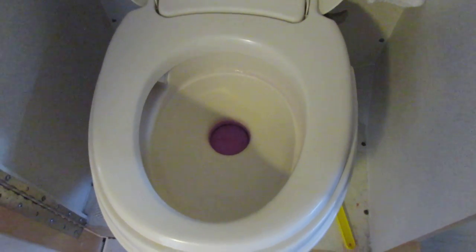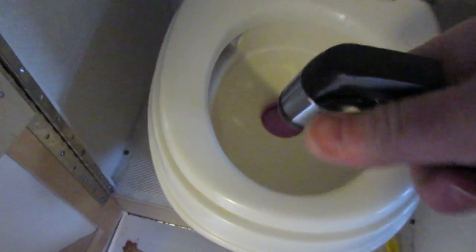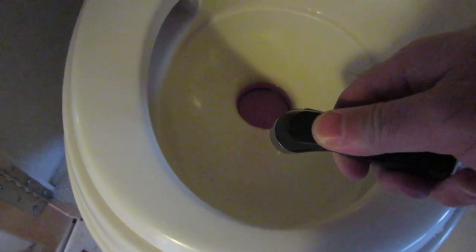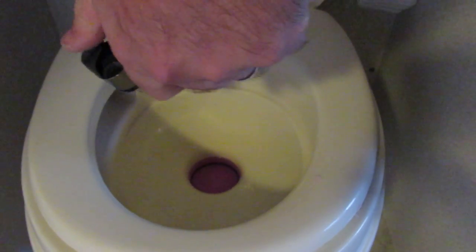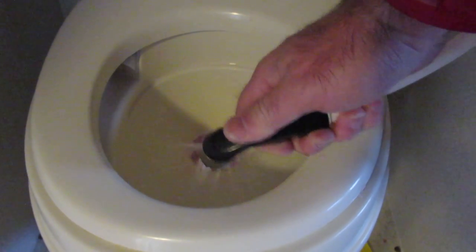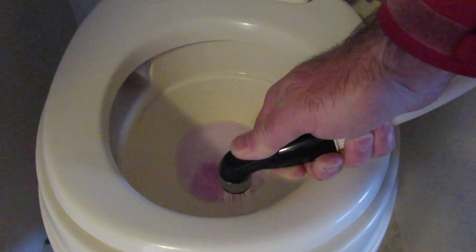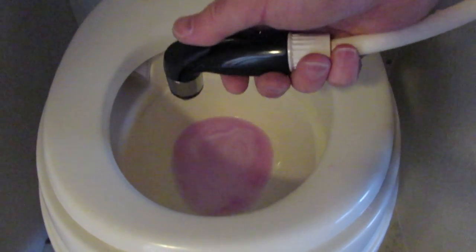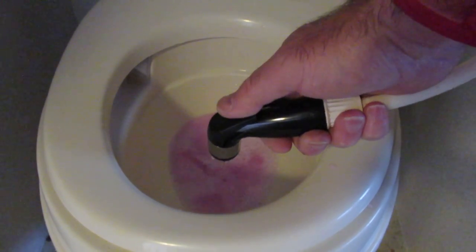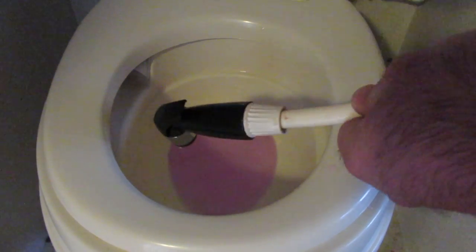That means we haven't run out of antifreeze in the exterior tank yet because the other pump stopped running — that's a good sign. I've never used this thing, I don't know what's going to happen, so bear with me while I get organized. I hate to have something I never use actually damage the camper. I'm going to turn on the hot and the cold faucets here. You can just watch this until you feel you're getting pure antifreeze coming out. I don't know what happens when you have both hot and cold open with the hot water system off, to be honest.